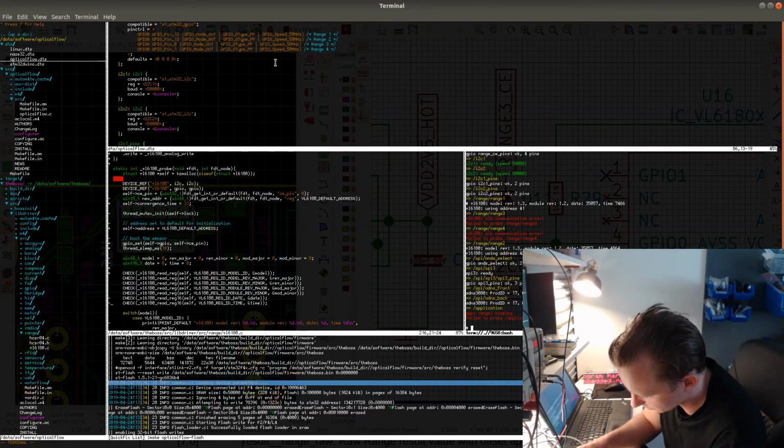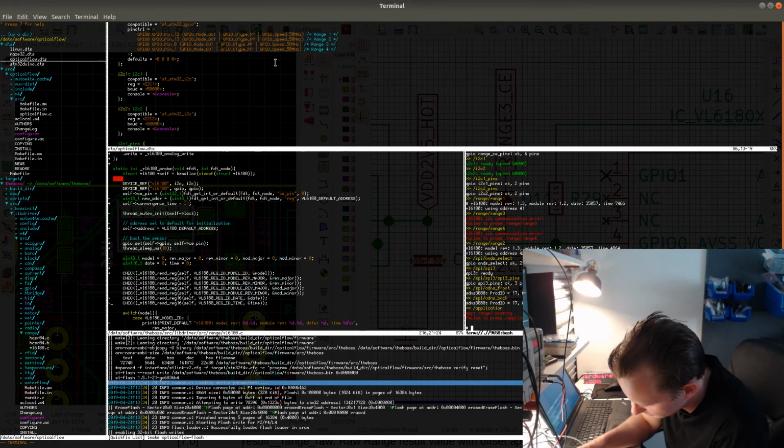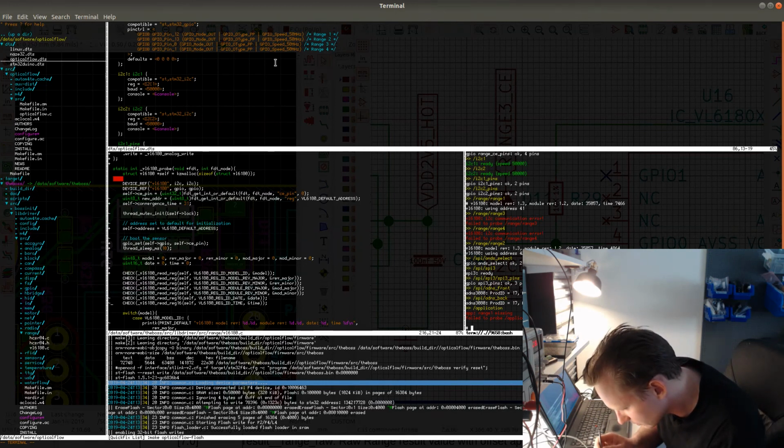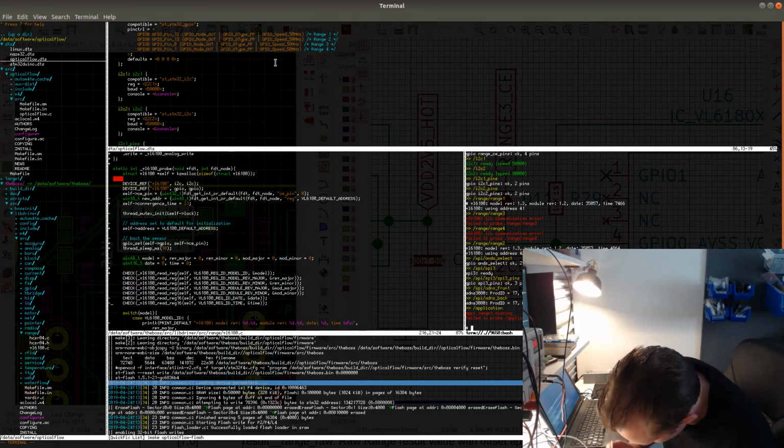But on the other hand, the diode that I moved seems to have had the correct orientation from the beginning. It didn't have the incorrect orientation. It's just that the silk screen is quite close to the pads of the diode, so I mistakenly thought that it had incorrect orientation. But the diode that will fix this is going to go to the chip that did not get the correct signal. Let's see. So this one goes here. I think this goes like this.